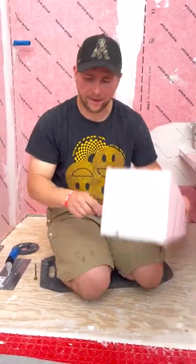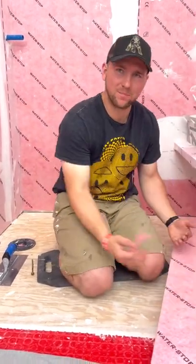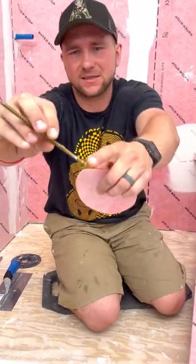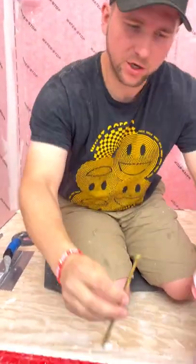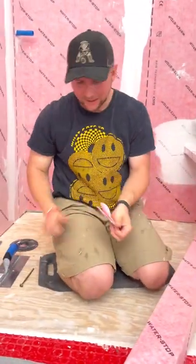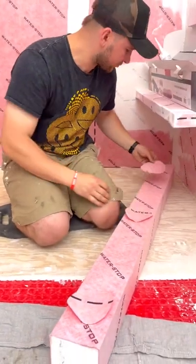Step one is to make sure that we get our curb installed. The curb does have a pitch on it, so make sure the pitch is pitched into the shower so the water would run off. We're going to use these six-inch GRK screws — you want to make sure it has this big wide head on it so it's going to grab the curb and pull it down to the ground. Then we just have these little patches that I made to cover the screws, and it stays a hundred percent waterproof.